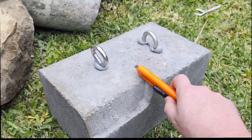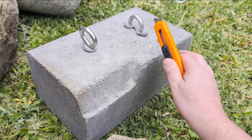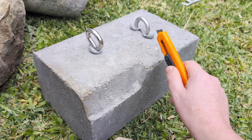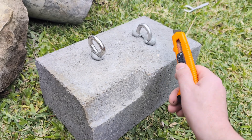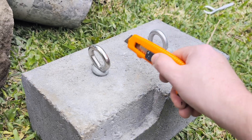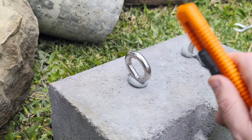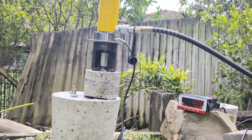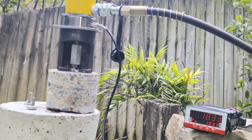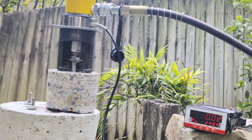This stuff here is not rock — it's actually like a retaining wall block, meant to be about 15 MPa or so. Pretty weak, representative of soft sandstone kind of material. I've got a U-bolt and an old P-bolt; this is the second pull test it's been through and it is a bit deformed. First polyester — let's see how it goes. 24.94.